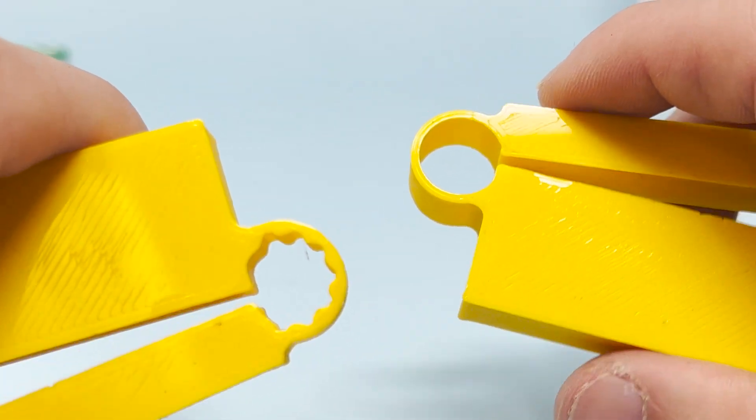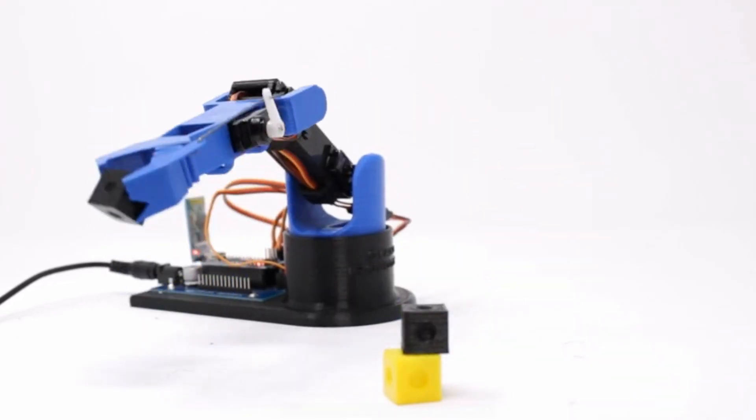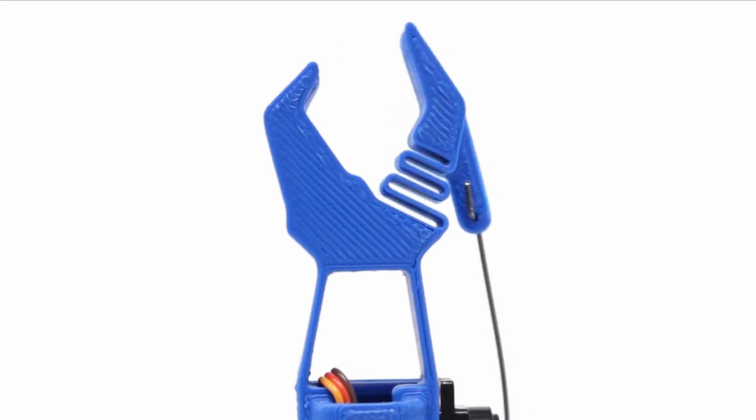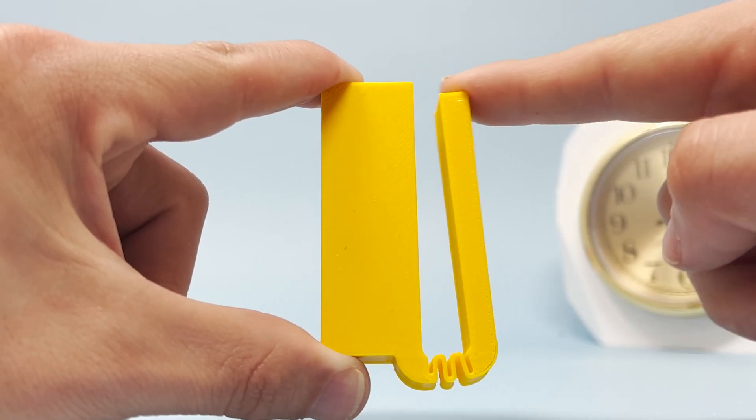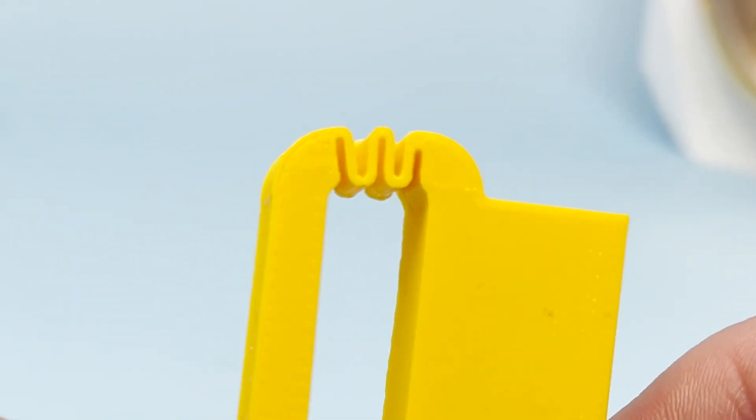The circular hinges are another way of doing living hinges, but sometimes that circle will pop out too far into a particular geometry, so you might still want that flexibility with much less protrusion. A long time ago on a project we did with robots, we actually created a gripper finger using this kind of spring hinge. This sort of living hinge is very useful because you get a good amount of flexibility with very little wear, since no single part of the hinge actually has to flex very far.